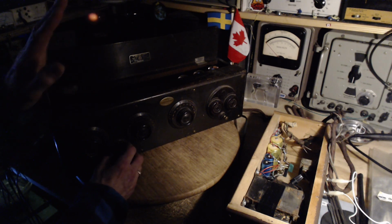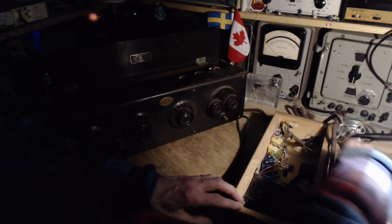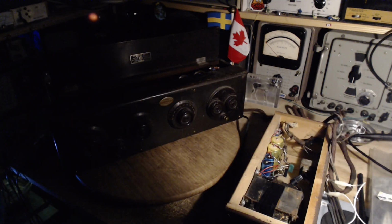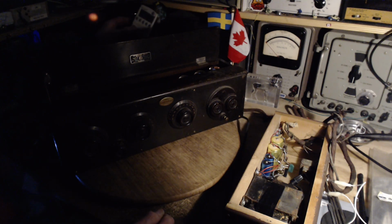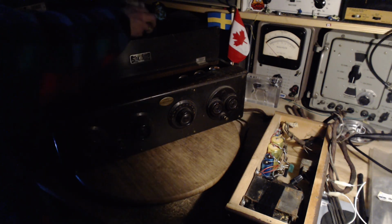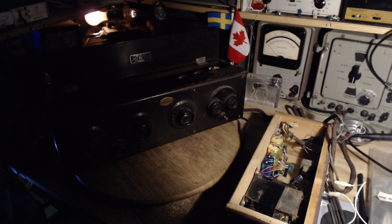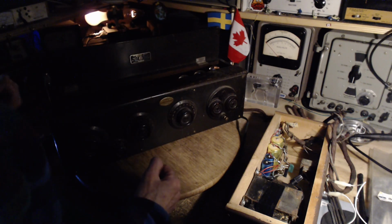So I'm hearing nothing, like no clicks or anything out of that speaker. Let's try this. This is the speaker wire here. Nothing from the speaker. Okay, so at this point we're operating now with 96 volts. We'll go a little higher. Oh, these tubes really turned on at this point. The light bulbs rather. So much more current is flowing now in the radio.